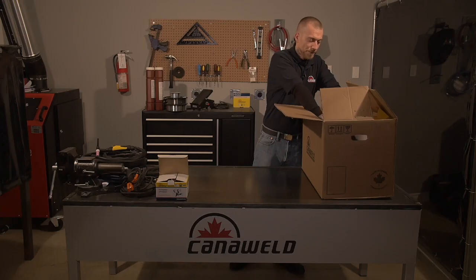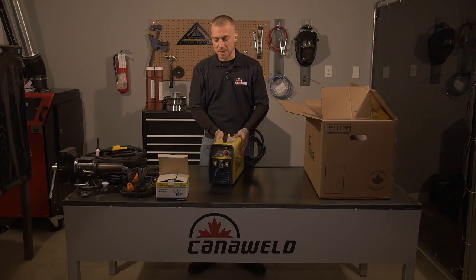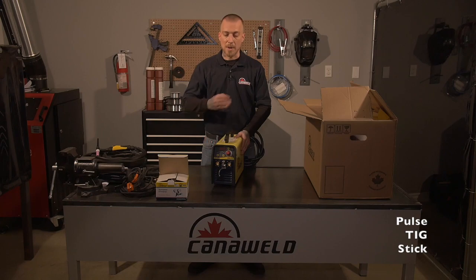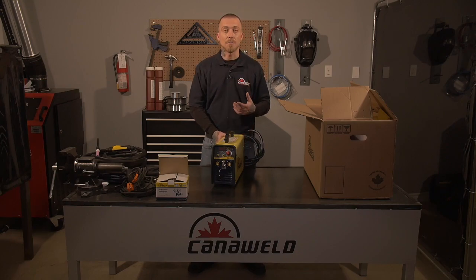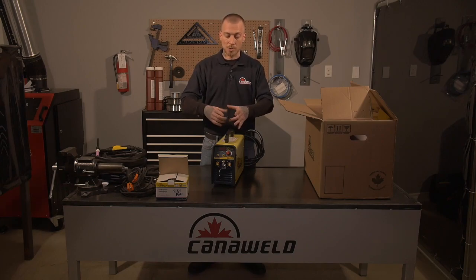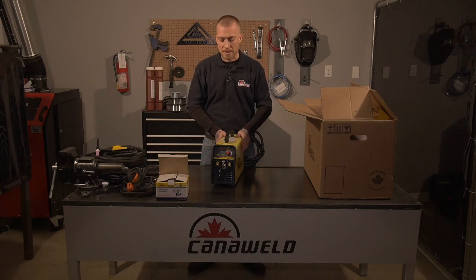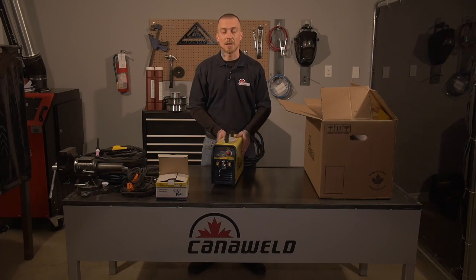Now we'll take a look at the machine itself. This is a 200 amp machine and at 160 amps it's got a 100% duty cycle. It's got the pulse TIG welding feature, which takes a lot of the hard work out of making a really nice weld, and you can also stick weld with it. The pulse welding feature allows you to travel faster and you put less heat and distortion into the metal. Say you had to weld around a hole or a cutout — you can flick it into pulse and go around it without distorting all of the edges. It's a nice feature that lets you get a really nice finish without as much training, and without sacrificing any of the penetration or strength involved.